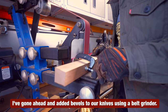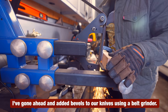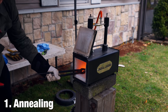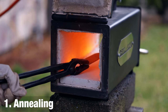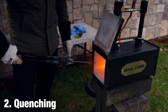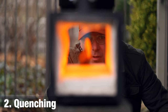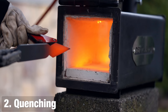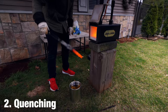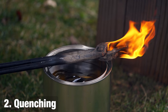Annealing removes the molecular stress. We may not need to anneal our steel since it was laser cut and not forged, but we're going to do it anyway since it's so easy. We're going to heat up our steel just past the point where it's no longer magnetic, let it air cool, and repeat two more times. After that, you quench. Quenching hardens the steel so it will hold an edge. The carbon content determines how hot and how fast you need to cool. For 1095, we heat just past the point where it loses its magnetic properties and quickly cool it in 140-degree canola oil. There are a million ways to do this — many knife makers will tell you not to use canola oil, but this is just the quick and dirty way.